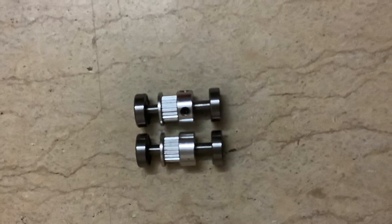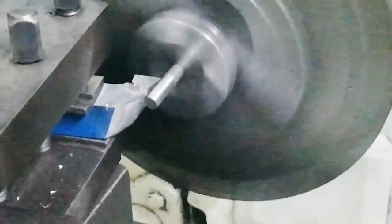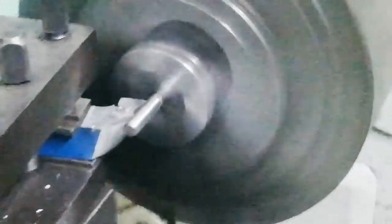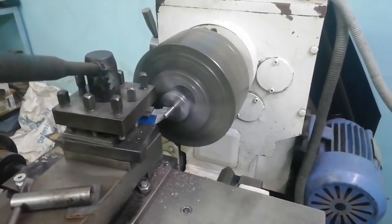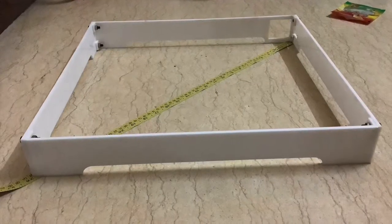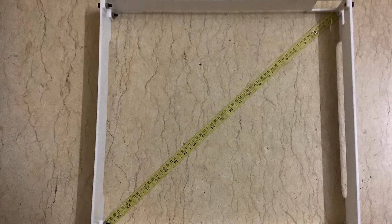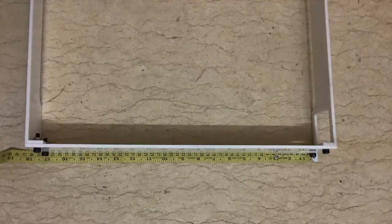Come, let's go into the machining part. This is how I turn the SS rod and fix it with bearings for the moving purpose. The machine's working length is 450 x 150 mm, so we can almost work on A3 size with full extension.